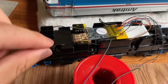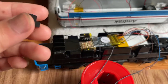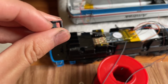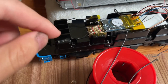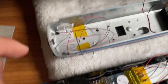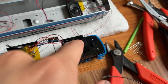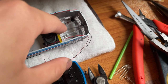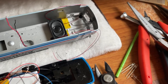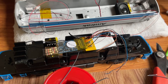The original lighting setup had this block holding two lights: the top hole held the red marker light and the bottom held the incandescent bulb for the headlight, both pointed forward. The three top slots had the middle one for the red emergency strobe light bar, and the outer two were incandescent bulbs for the number boards. Since I'm removing it on this side, I'll have to find another way to fit the lights and cover them with light boxes so they don't bleed into each other — but that'll be interesting for sure.